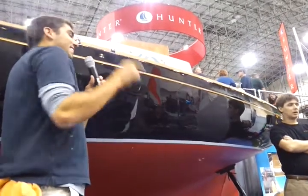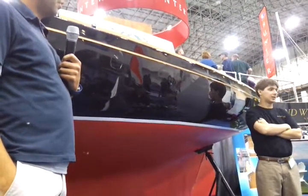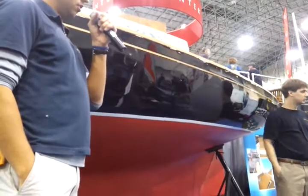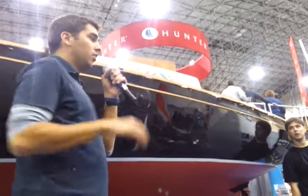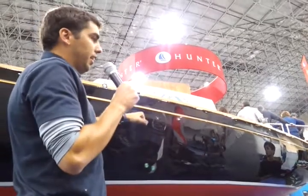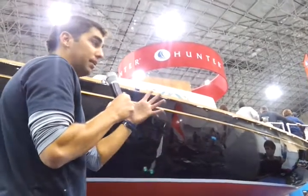Try buffing it. I would think of it just like oxidation or just like the scratch we put in, and you can even start by wet sanding and finish it all the way down. For non-skid decks? No. Not a deck, non-skid, hard. Well, for any of the smooth surfaces, this application is best. We recommend buffing, polishing, and then using a protective wax for UV and just keep it clean.